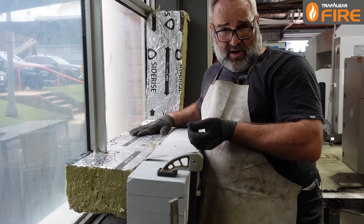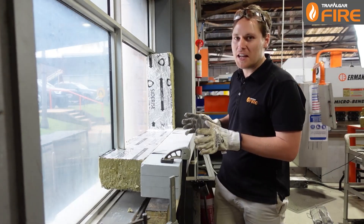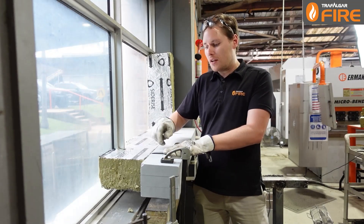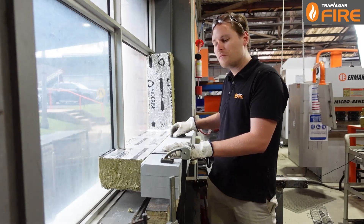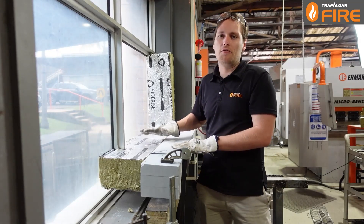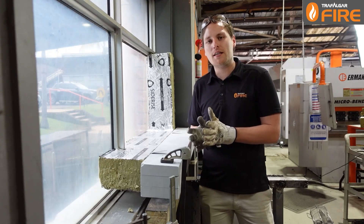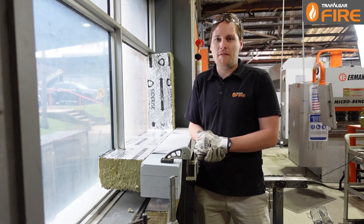John's gone to get the pliers, so I'll quickly recap on what we've done. John's walked you through how to cut the Siderise and how to use the brackets. You're going to need some masonry anchors to fix it into the concrete. At the end of the day it's a really simple system — no continuous metal angle flashings. Siderise CWFS is a fire and smoke seal all in one, not to mention the thermal and acoustic benefits. It's a really well-rounded product, simple to support technically, and something you should really be considering for your next project. Thanks guys, see you next week.